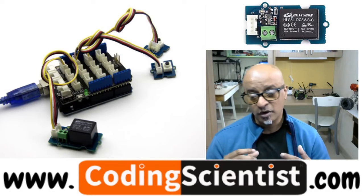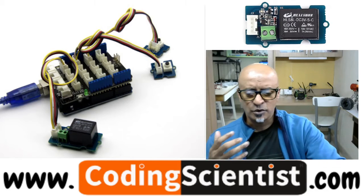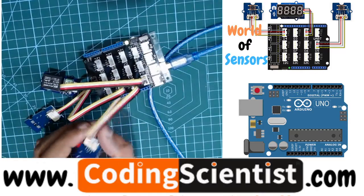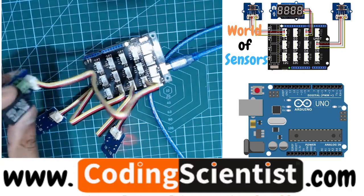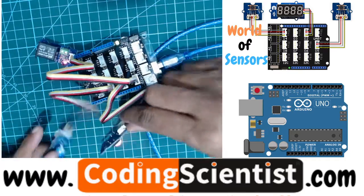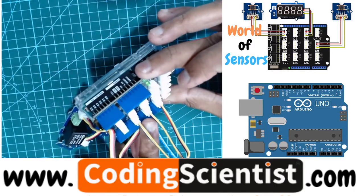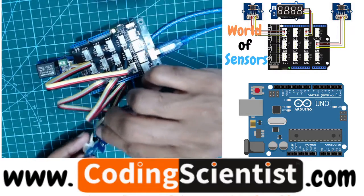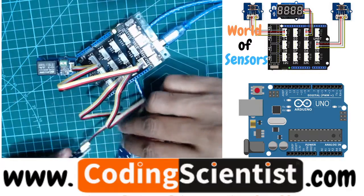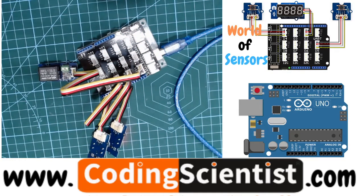There is also an indicator LED on the board within the sensor which will light up when the control terminals get close. So let's build a very simple program. I connected two buttons — the relay is connected to D4 of the shield, this is the D4 port if you can see here. And two different LED switches are connected at D3 and D2 — two different push button switches which come along with your kit. This is red and this is blue. Each switch has an inbuilt LED as well, so we can build a ton of stuff using this.